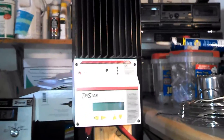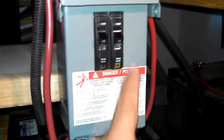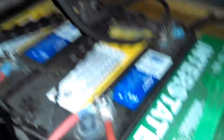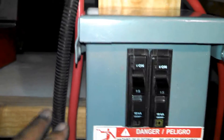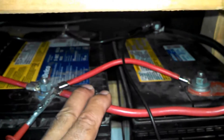Here it is. How I hooked it up: I installed a switch here that brings power from the positive of the 24-volt bank. The negative leg goes directly to the negative of the charge controller, and the positive goes through this switch to the charge controller. Then the charging line comes to this switch and goes to the battery, so we have the feed from the charge controller to the batteries through a switch.